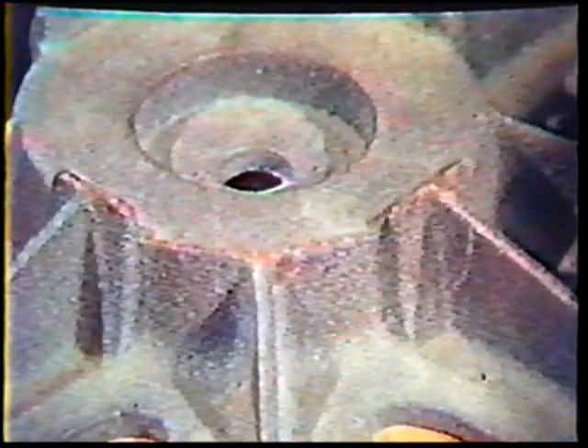Iron castings have a tough skin, which may have flaws such as air holes and mixed-in foundry sand. It is brittle — it will break rather than bend when hit with a hard blow. The dark gray appearance of the broken surface is due to the free carbon, and is the reason it is called gray iron.